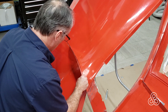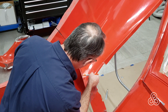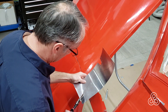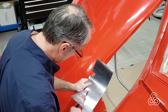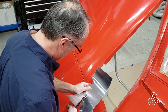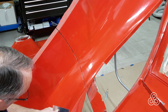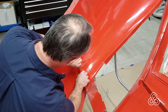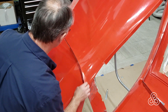That done, moving to the back joint — the door and the back of the tub. This is a radius piece, so I'm tracing off the radius so that it won't be sticking up too high above the mold so I can work both sides. The last one on this door is going to be the very bottom of the door, going back to the heavier gauge — the 20 gauge galvanized metal. That produces a much smoother edge.